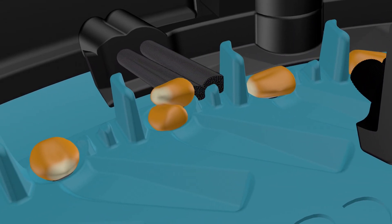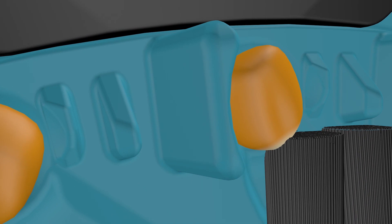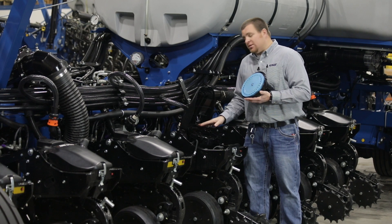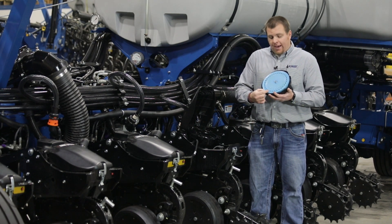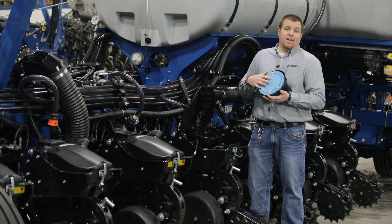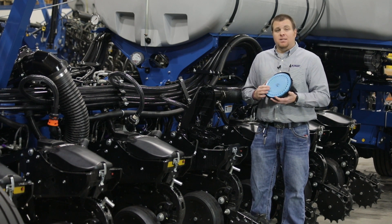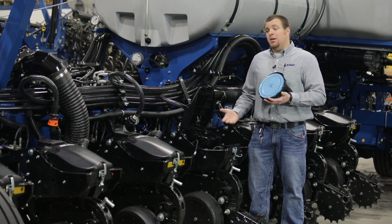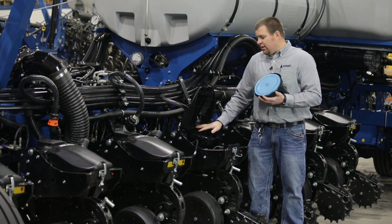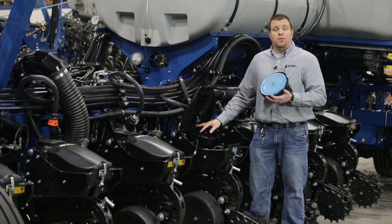The nice part about that design with the paddles and stair steps is our non-adjustable singulator that is inside our meter — it uses brushes. What that allows us to do is our brushes are very aggressive, but with our paddle and disc design it allows those brushes to be aggressive yet no adjustment is required for any crop type. So for small to large seed ranges, it doesn't matter. Almost to the simplicity of a finger meter where it's a pour and go — pour in the seed and go plant. So no-adjust singulator, it's a floating style singulator with around four to five hundred row acres of life.